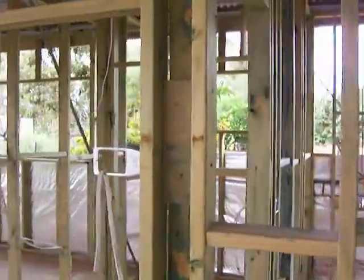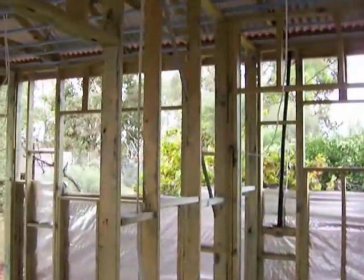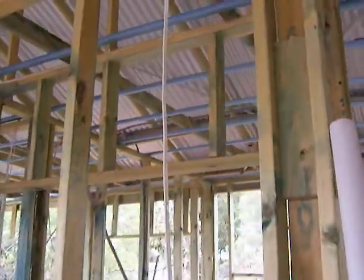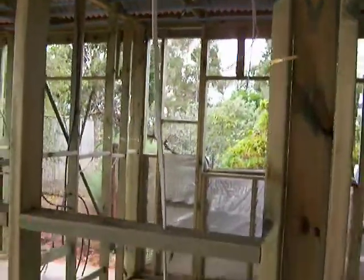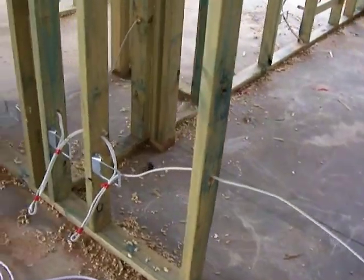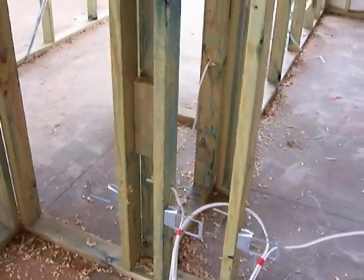Just wanted to show you what we get up to from day to day and give you a quick look and an insight into some of the electrical work that goes on in a house. The boys drill the holes through the top plates and bring the wires down the wall cavities, down into the power points. Then we loop back out of the power points into further power points. We've also got some brackets in there for a data point later and obviously some TVs and what have you.